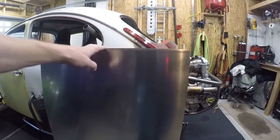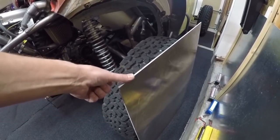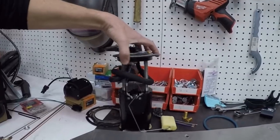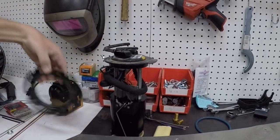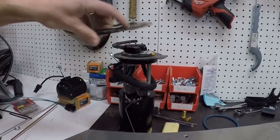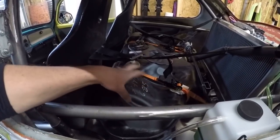This one's a little bit thicker than I normally make for fuel cells, but this one's going to be in the cab with me so I'm really going to make it pretty robust. Over here I've got another piece that is 0.190 inches thick, which I'm going to use to make some mounting flanges on top for the fuel pumps. I'm going to make it with two fuel pumps — this is the factory fuel pump — and I'll need to make some sort of a ring that these will set into, and then some plates that sandwich the fuel pump and screw down into the cell with a gasket to seal it off.